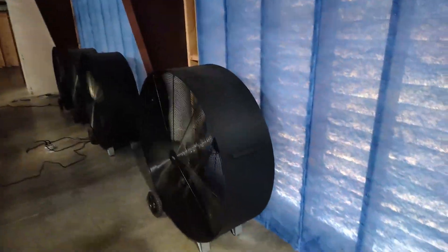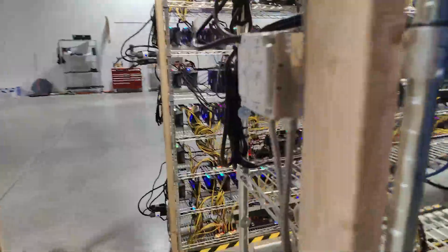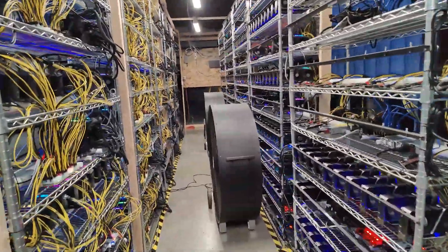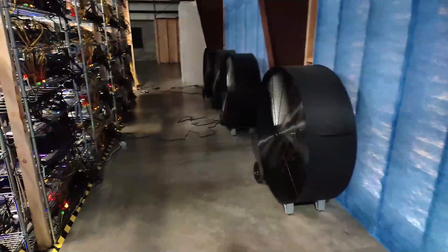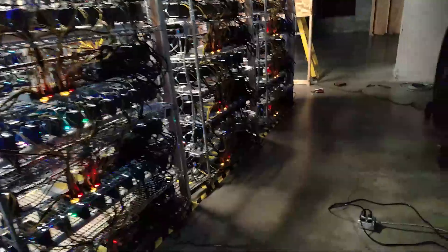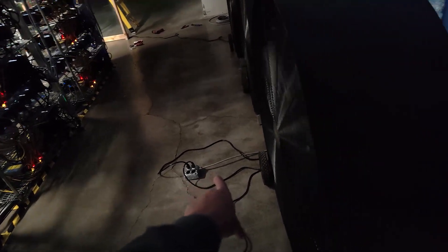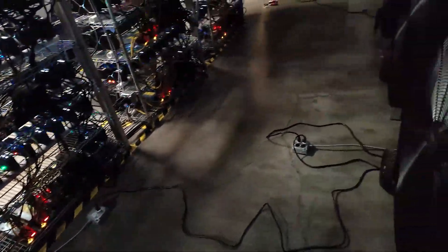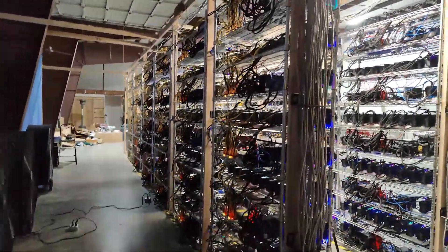In terms of fans, you can see our intake fans here — we have four of them. I'm gonna add another one, so that'll be five. Then we got two fans in between the rows. These are all running at really fast speeds: 22,000 CFM on turbo, doing a good job — you can see the suction really sucking up that filter. We're pulling conduits for these fans, just two plugs, 20-amp conduit. These are 120-volt fans and we're installing some of the conduit here.